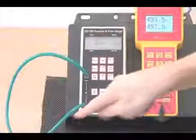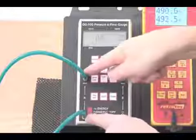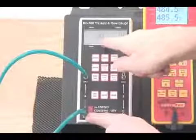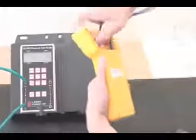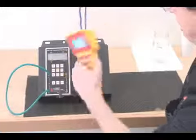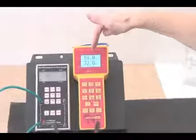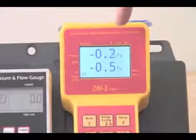and now we connect the tube across these ports, and even though we have a pressure in there, we're not experiencing any pressure right here because we're looking at the difference between these two ports always, and there's no difference between these two ports, so this is zero. And the same thing will occur here. We disconnect this tube, put it from one port to the next on the same channel, and this gauge will again drop down to zero, but because it's on 10-second averaging, it'll take a little bit of time to do so.